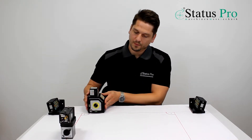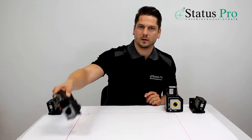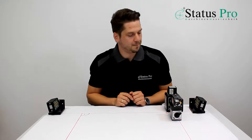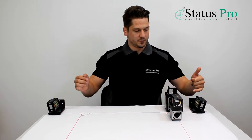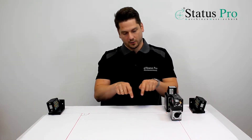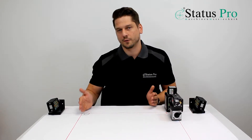Now we can move our laser in front of our second guideline and take our laser receiver and put it onto the support of our second guideline. Now we have to level the laser beam again and we have to adjust our laser plane — fully automatically — to the same values, and we have our reference back again. So we have our standing laser beam in the same position as in front of the first guideline.